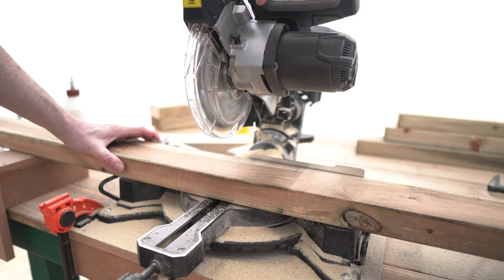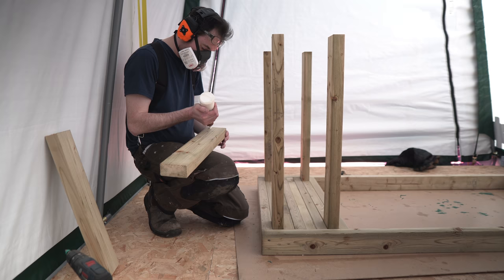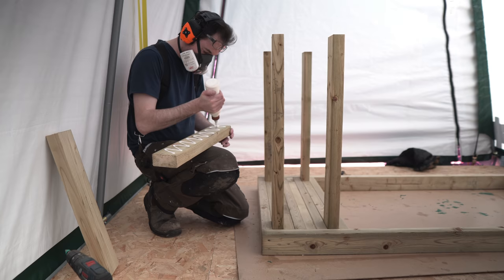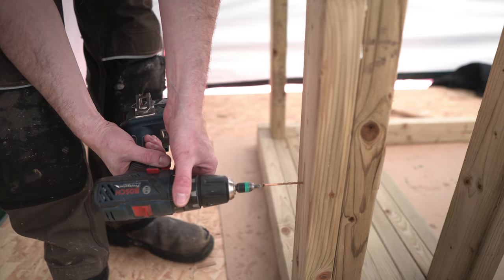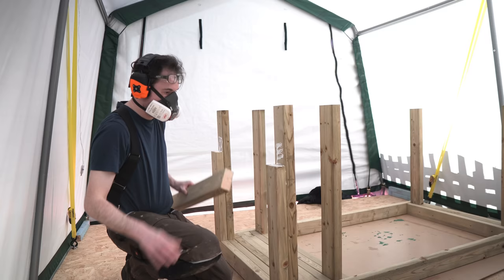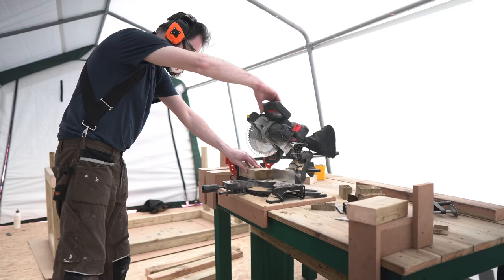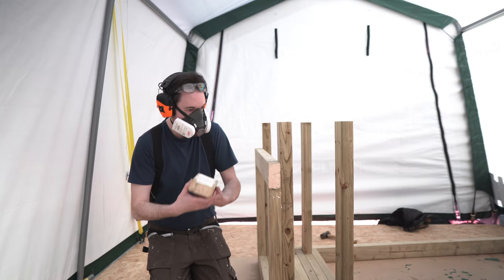I set up a stop and get another three pieces cut. At the moment all the weight of the legs is on that one screw, so I want lots of support underneath so the energy from hitting the top transfers down through the legs. I've got six pieces cut to the same length — they get glued and screwed into place against the existing leg to offer support under the table. With those in place the cross member gets glued and screwed in, and then I cut some little pieces to fill the gap at the bottom, giving me really chunky legs to transfer force all the way down.